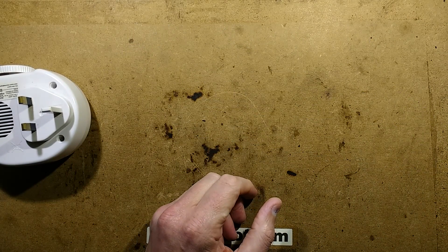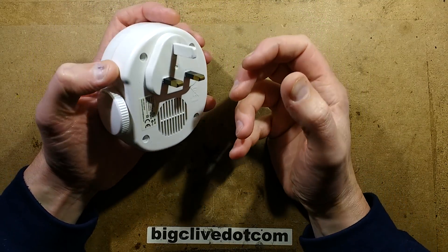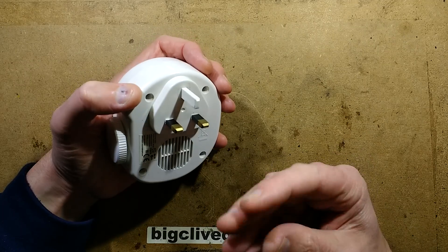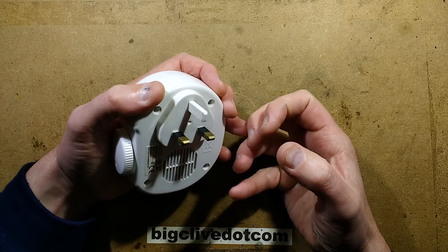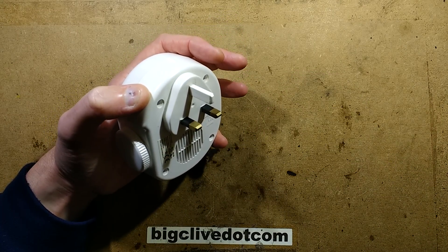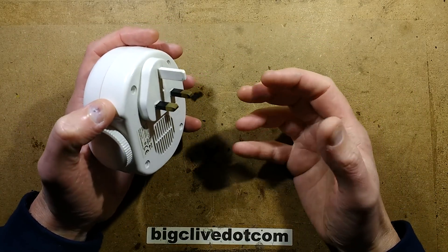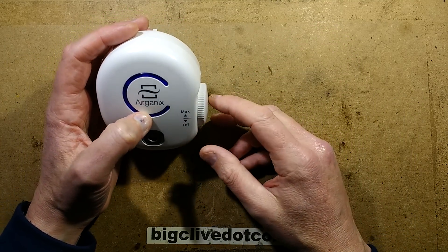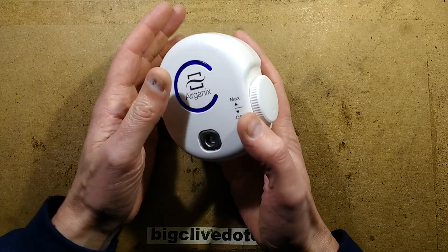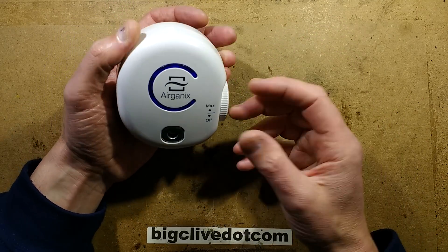This is one of these things where some people say it's really hazardous and you should not breathe ozone at all because it is so dangerous. In high concentrations it is dangerous. At 100 parts per billion you can smell ozone as a sort of bleachy smell — quite nice at low levels, really horrible and nauseating at higher levels. At higher levels it makes your eyes sting, your nose run — it affects the mucal membranes, the nasal passages, anything wet that is most receptive to it — basically oxidising them. Some materials are also prone to oxidisation; rubber is very prone to ozone damage, causing it to embrittle, crack, and craze. To protect rubbers they'll often put a wax sealant or oil on the surface.